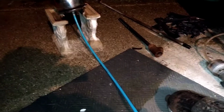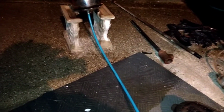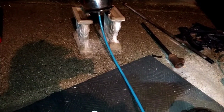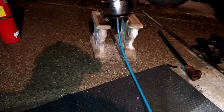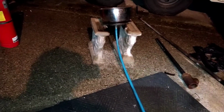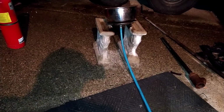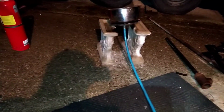I have stuff on the way to make this easy to load, easy to operate. Eventually, if it works how I conceive of it working, I should be able to have a secondary burn chamber, like an afterburner, in the case of just pure heating, or ultimately you heat your garage with this device, or an outdoor space, or ultimately if it was scaled up, indoors. But you could heat it, and then the combustion engine generator, the 4-stroke, this runs through the standard wood gas filtration system, or one that I actually created. And then after it gets through that, scrubbing a lot of the tars and cooling down the gas, it's suitable for operating an engine. So I want to be able to take this exhaust from this wood heater, scrub it up, get the wood gas ready, and then power a generator with it.